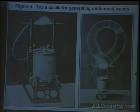It contained identical essential parts disposed in a like manner, but was specially designed for use on supply circuits of higher tension, from 220 to 500 volts or more. The usual adjustments are made by setting the contact spring and shifting the iron core within the inductance coil up and down by means of two screws. In order to prevent injury through a short circuit, fuses were also inserted in the lines.